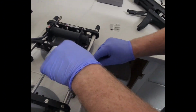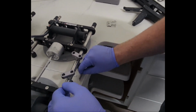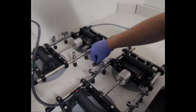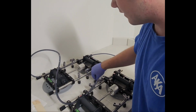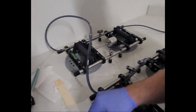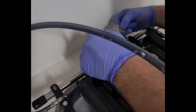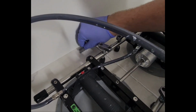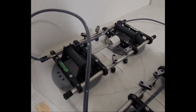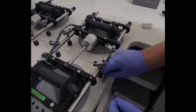What are you looking for here when you're checking across the seam, Andrew? I'm just checking the levels of the seam, making sure we get it perfectly flush across there. So what I'm doing is when I'm sliding the razor blade, I'm just feeling for any little vibrations or catches in the razor blade. If it goes like this, I know I hit an edge and I gotta lower that side down. But right there, that goes across nice and smooth, so I know that it's gonna be a perfect feeling seam there. I don't feel any catch. I do the same thing in the front, middle, and the back to make sure I get them all evened up. So on this one, I'm getting a little bit of catch on this piece here, so I'm gonna lower off my jack screw a little bit until I don't get that catch anymore. Perfect. Then you just gotta keep working your way across until you get it all to feel.